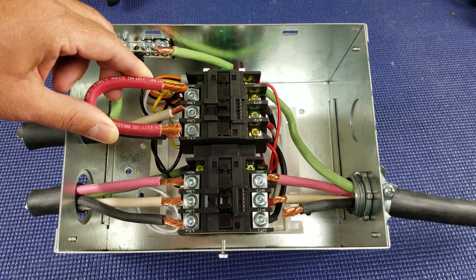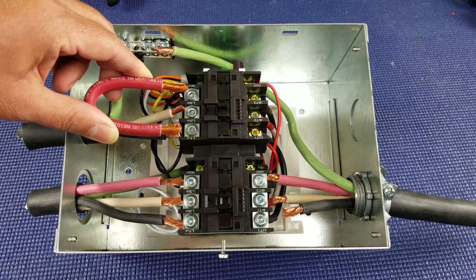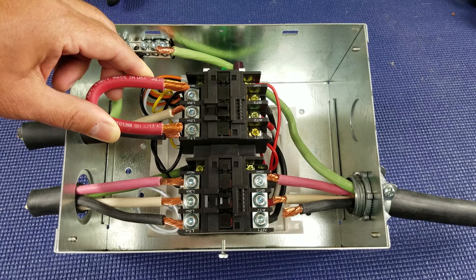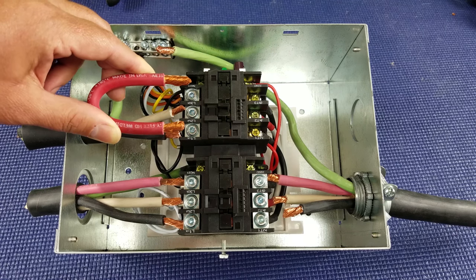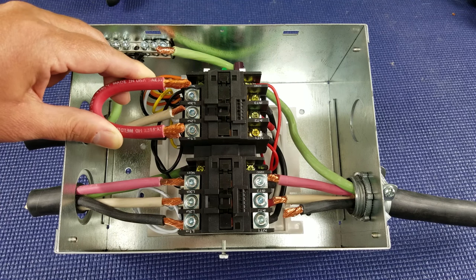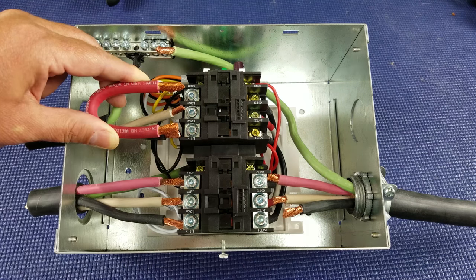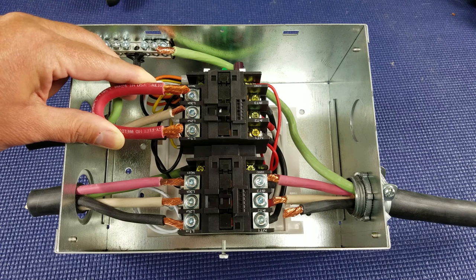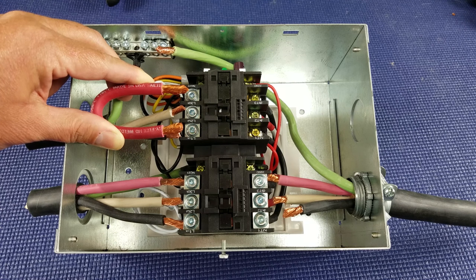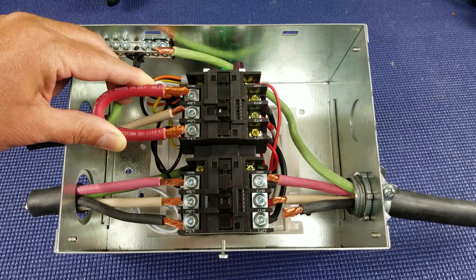With this setup you're probably not going to be able to run your air conditioning unit, but everything else works fine — microwave, hair dryers, plug-in computers, everything. You want to use a smaller cable and connect from L1 over to L3 to get both legs powered, so all panels in your distribution panel are powered up and all outlets in your trailer work, except for air conditioning.